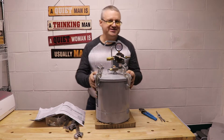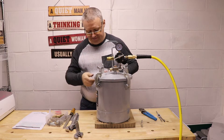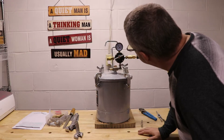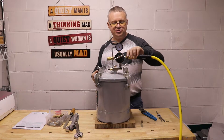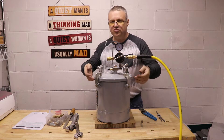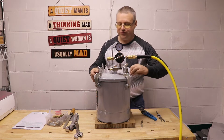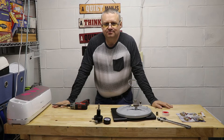If this says it's a 60-pound tank, as long as you've got this pop-off valve you're never going to get 60 out of it. Right now the pressure valve on the compressor says about 35 to 38 pounds. Unfortunately I can't just remove it because I don't have any valves on it right now, but overall it's holding pressure well enough that I'm not going to try to return it.